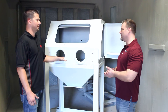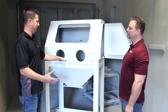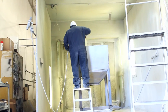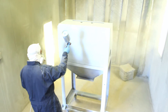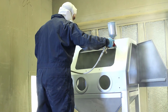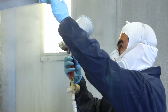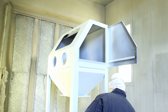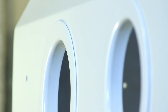Nathan, tell me the type of paints that we use in the process of painting a crystal blast piece of equipment. Here at Media Blast and Abrasive, we chose to go with a polyurethane catalyst paint, much like an automotive paint. When cured, it's really comparable to a powder coat, if not harder. It's a lot more cost-effective, a lot better for the environment. It uses a lot less energy — you don't have to heat the product, it does air dry. And when it hardens, it's much like an automotive paint. Most manufacturers that choose to powder coat, really the fact behind it is when they use a hammer tone finish or one of those textured finishes, it's really to hide the flaws in their manufacturing process. With our cabinets and the paint that we use, we're not trying to hide anything. So we use the highest quality paints and process and we're not powder coating because we have nothing to hide.